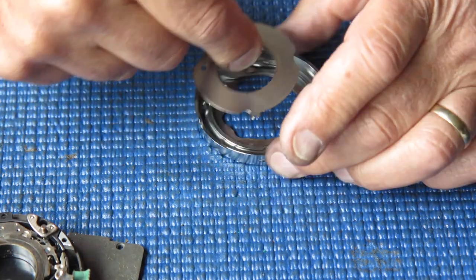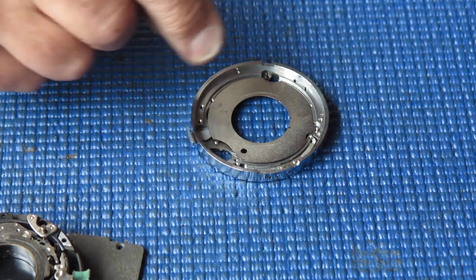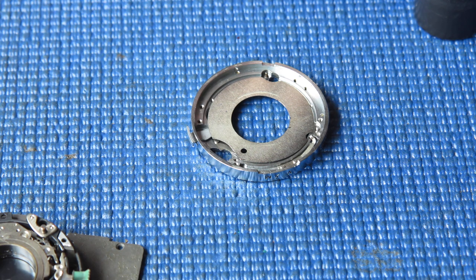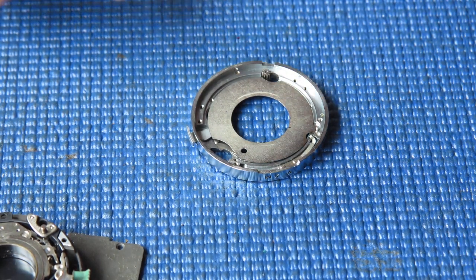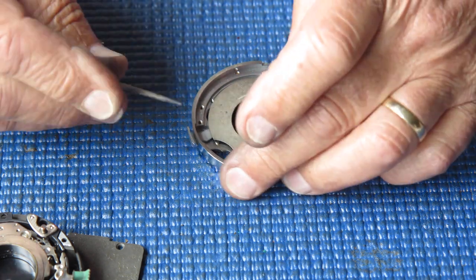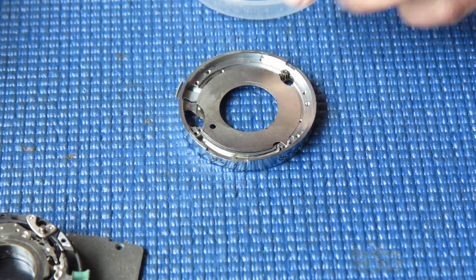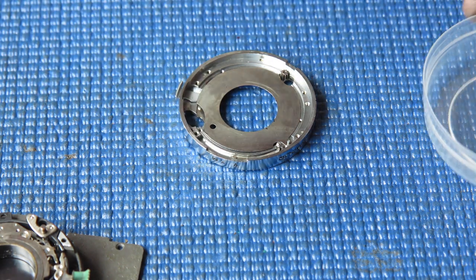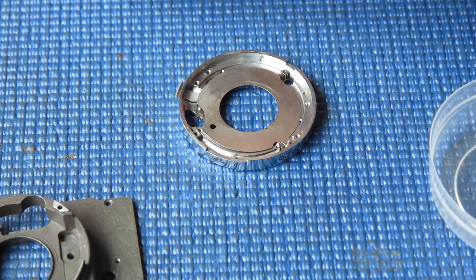I've got to assemble this correctly so I've got to put that plate in position. It fits over a pin here, and there's another pin over the other side — that pin is for the gear. The little pinion has a little recess in it; the recess goes down over the post like that. I'm putting a touch of molybdenum paste on the end of the spring here because I want it to retain the detent ball while we're getting everything assembled.